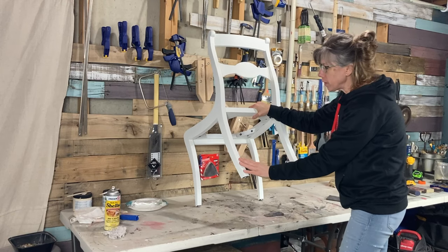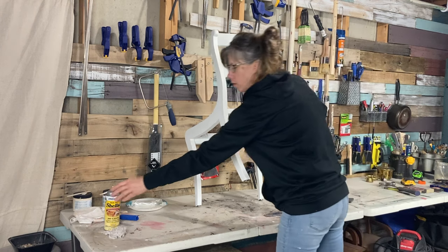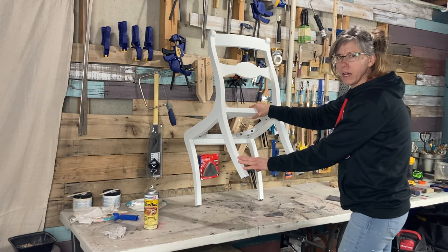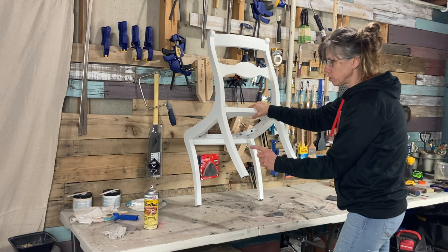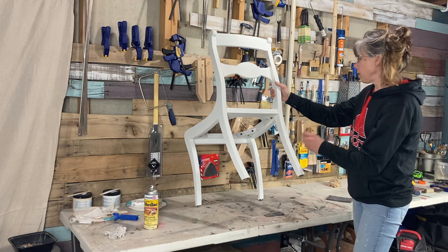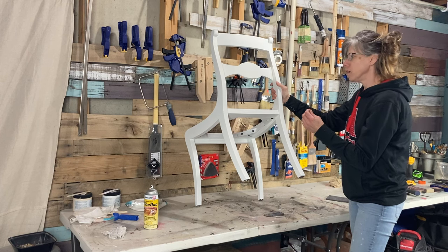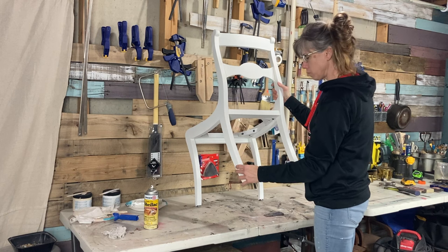What I'm doing right now is I'm checking to see if there's any bleed through that I will hit with a dose of shellac, but also to make sure there's no debris that got caught up in the last coat of silk paint, which we're using the Whitecap color. And although I'm using a roller and stippling with a brush for a very minor amount of texture, I don't want actual chunks of debris being observed.